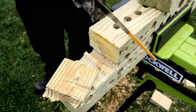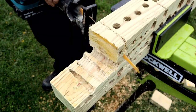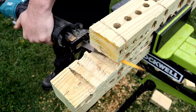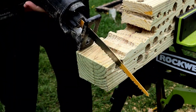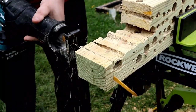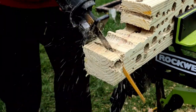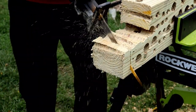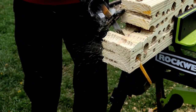This is probably the most fun I've had using a reciprocating saw up to now. Maybe I was just in the mood to slice and dice, but there definitely is something about this saw. I don't know if it's the weight, the way it feels, or just having a little bit of power with the lightness. For people that work over their heads all the time — cutting rafters or whatever — I think you're really going to like this just because of the weight. You're looking at the two batteries and thinking it'll add extra poundage, but it really doesn't. It's just a very well-balanced reciprocating saw. And even without the orbital action, I'm not having any issue cutting through a lot of stuff.